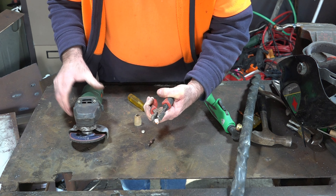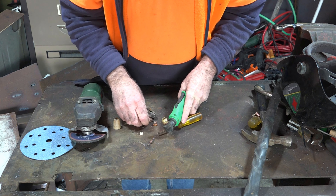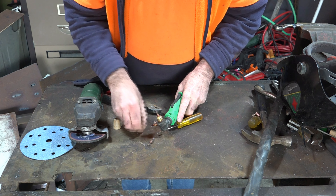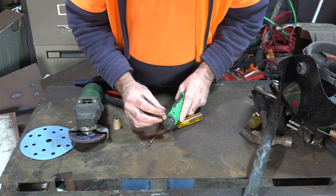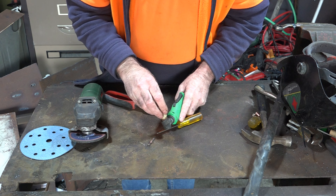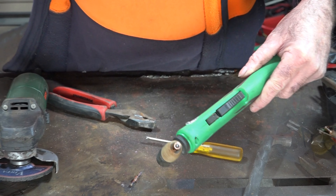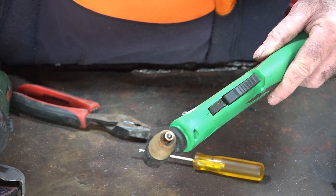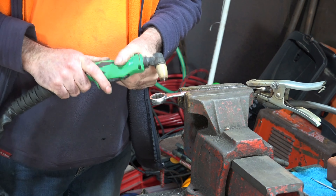So we've got something that looks like this guys. Then what we want is to get a buggered electrode - something that's seen better days. We can use a new one if you want, but why waste a new one? Like I say, I'm tight. So get a buggered electrode. And then we need a swirl ring like so. We just put it back together as normal - put your swirl ring on, put your nozzle on that we modified, put the top on it. And you end up with something that looks like this. Right, so let's have a go this time and see if it actually works.